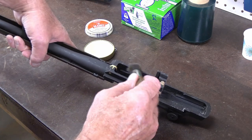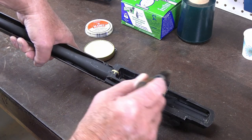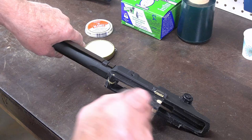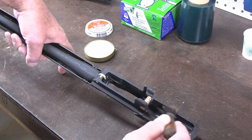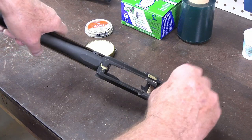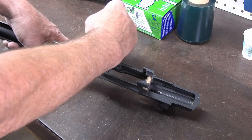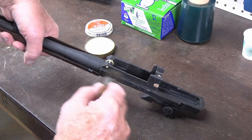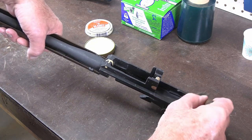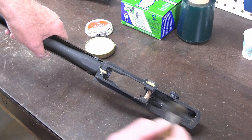So anyway, I'm applying this wax, even though we're not bedding on the inside. It might creep up. You can always chip it off of steel that's casually contacted with the epoxy, but it's a lot easier to remove if you use this wax. And this wax is totally harmless to the gun. You might see little balls of wax. Those would be no problem at all. That doesn't impart any thickness or surface that is going to inhibit the epoxy flow in whatever way possible.